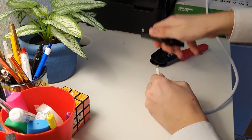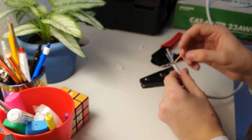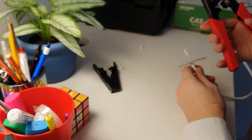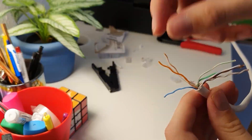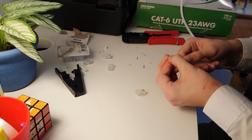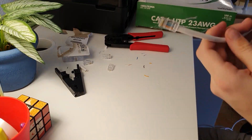If you're doing your cables yourself and don't know how already, here's a quick tutorial. Strip the end of the wire. Unwirl the small cables. Line them up straight in this order: orange striped, orange, green striped, blue, blue striped, green, brown striped, brown. Cut them evenly. Insert them into the connector. Use the crimping tool on the connector. Repeat for every cable. If you ever want a more in-depth tutorial, please let me know in the comments below and I might consider it.